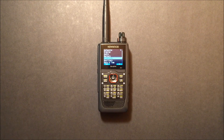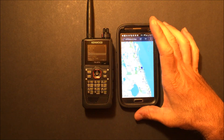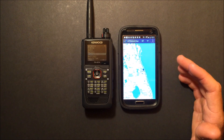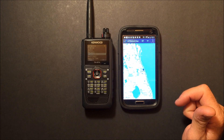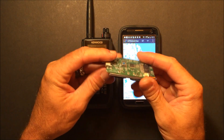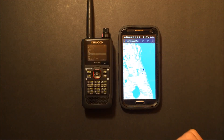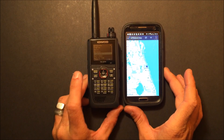I'm really impressed that this has Bluetooth — for two reasons. Right now I have my Galaxy S4 paired to the D74 on Bluetooth, and I'm using the APRS Droid app. Now I can use APRS functions on my phone — like messaging, emails, as well as messaging to and from cell phones. The TNC is built inside and the whole radio pairs with Bluetooth. No cables to get in the way. Previously that required a cumbersome setup with cables and external Bluetooth TNCs, but now you can do it all wirelessly. Bluetooth is awesome.